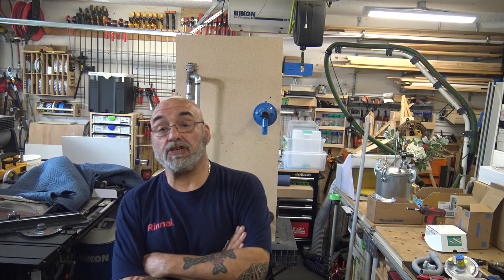But sometimes you need another product. Just to give you an example, it's called the Taco Metlund demand pump system. I get at least 3 or 4 of these questions a week, if not more. Someone says, oh my God, I just found your channel and I had an RU199 installed. I wish I saw your channel, I would have had the RUR. Can I put a thermal bypass valve in? No, you can't. You need to run a dedicated recirc line. It's impossible, my house is finished. Okay, you call me, I speak to him.